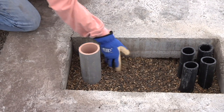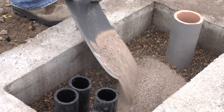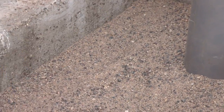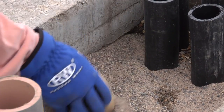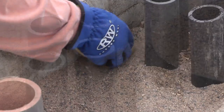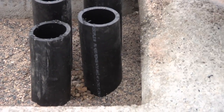After calculating the amount to be used, prepare the target surface area. Fill any deep holes or rocky crevices and cover pea gravel with at least one inch of sand or dirt. Pea gravel that is left uncovered will allow the Instagrout matrix material to filter through, causing a poor seal. Try to make the surface as level as possible. Instagrout sealant barrier will flow to and fill low spots on the target surface, but it works best on flat areas. Sand is the preferred surface filler for Instagrout.